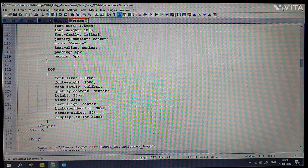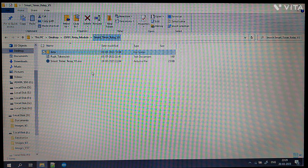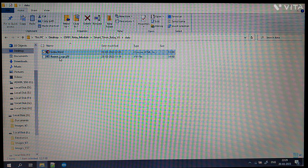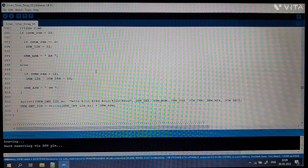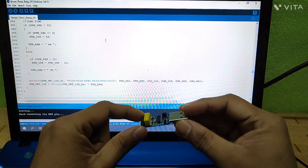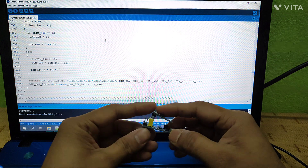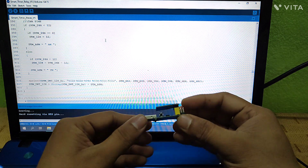What you need to do is keep the HTML and the web logo inside the folder where you have the Arduino code. Inside that, create a folder called 'data' and dump your HTML file and the logo in there. Then you can do the programming. I have this programmer with me, and you just need to plug the ESP-01 module into this socket.